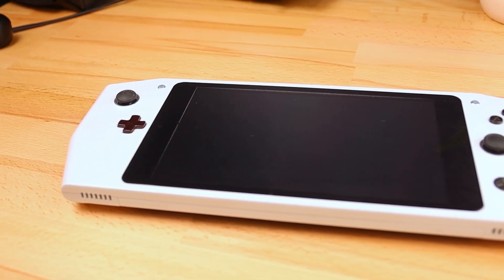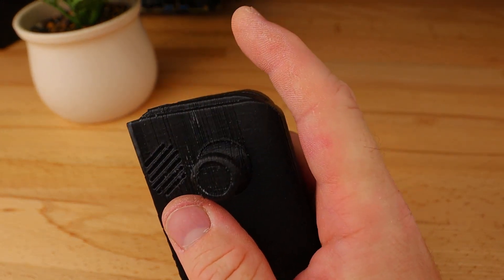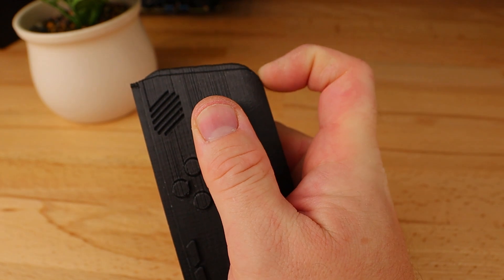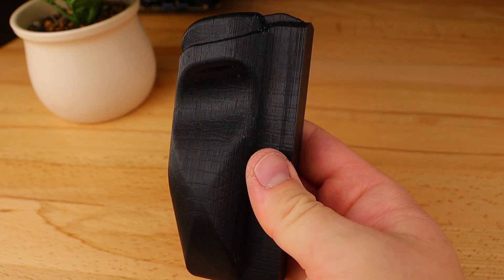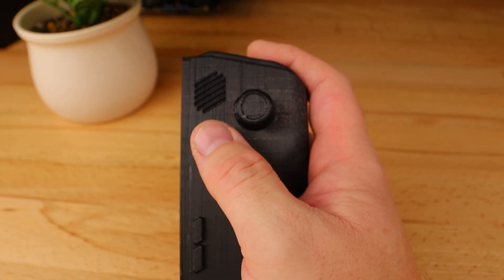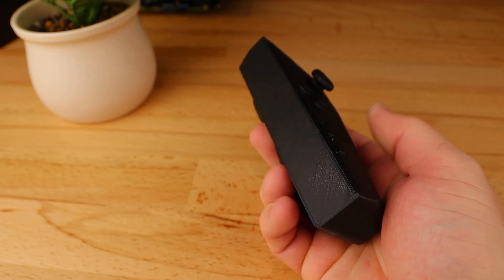I'm keeping a similar grip design to the original NUC-DEC, but because this console is a bit wider and the joysticks are up higher, I'm going to take an angled cut out of the bottom corners to help angle your hands and arms properly, like I did on my first big handheld, the DIY UFO. With a rough design in place, I printed out half of the controller to try in my hand. The shoulder button on the first attempt was a little too square, so I angled it more and increased the palm cut-out. The second one felt better but was still a little harsh in the corner, so I reprinted with more of a radius and ended up with a design where the grip depth, shoulder and trigger buttons feel comfortable, and the joystick and ABXY buttons are in a comfortable position without requiring a major shift of grip.